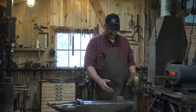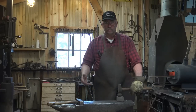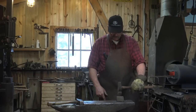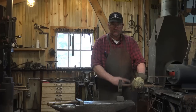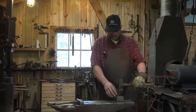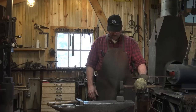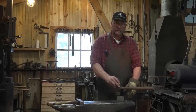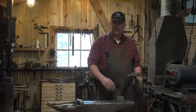The idea behind a spring tool is to have top and bottom tools that are hands-free. You don't have to hold on to something — hold on to the stock, hold on to the hammer. You don't have to have a striker or a treadle hammer or a power hammer; you can do this at the anvil. So our butcher will be the bottom butcher and a top butcher connected by a spring. I've seen old tools done this way, but they looked very much like regular top and bottom tools that the smith had added the spring to. The oldest ones would have had to have been either punched with a tenon spring put through, or something wrapped around somehow. Sometimes they're also hinged at the back.